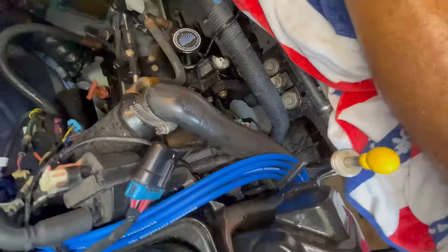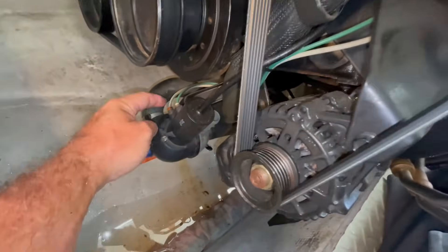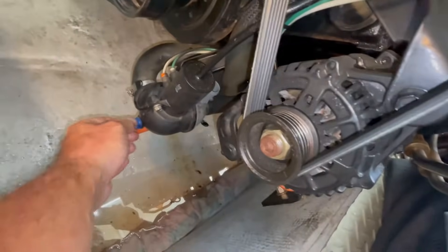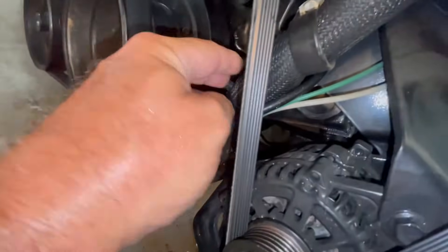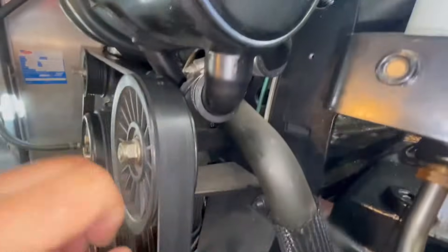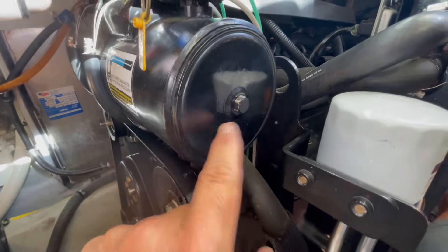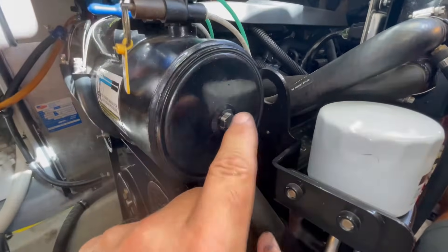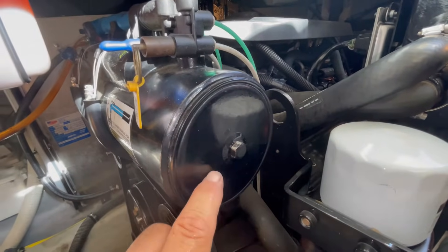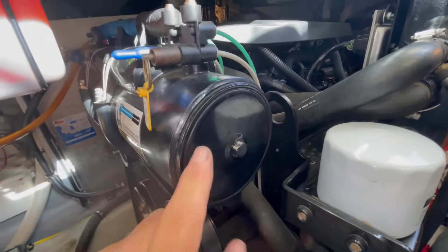We got the hoses hooked back up. The outlet from the trans cooler goes under the motor and comes to the front where there's a flush fitting for winterizing — you can pump air through the system here to purge all the raw water out. The water goes from the transmission through this hose, sneaks around the back, and goes into this port right here for the heat exchanger. I seriously doubt anything got pushed in here past the trans cooler, but we're going to open up this cap — there's a gasket around here — and see the condition inside. This was a freshwater boat until about a year ago, so it shouldn't be too bad, but I just want to make sure there's no debris or blockage inside this heat exchanger behind this cap.